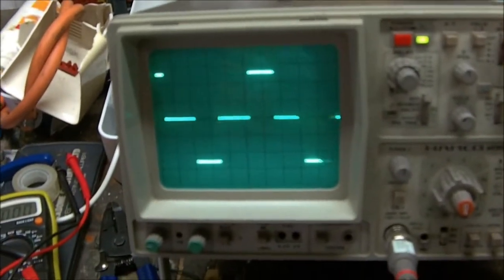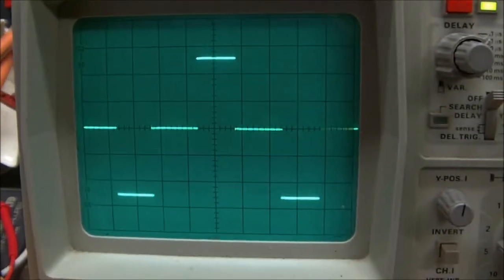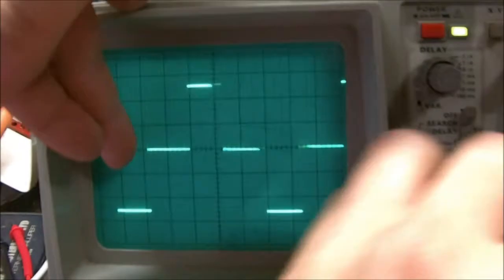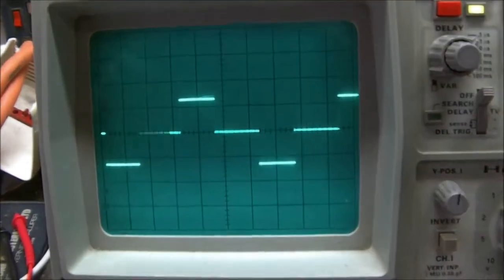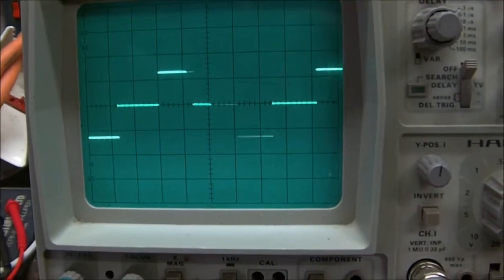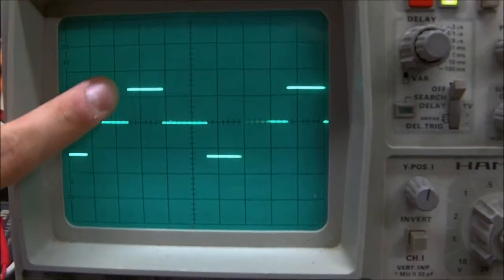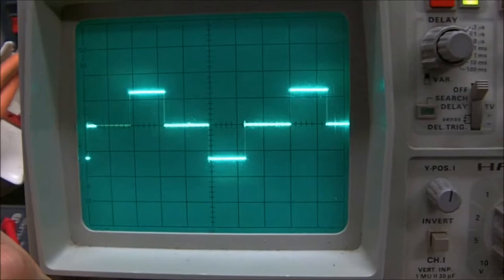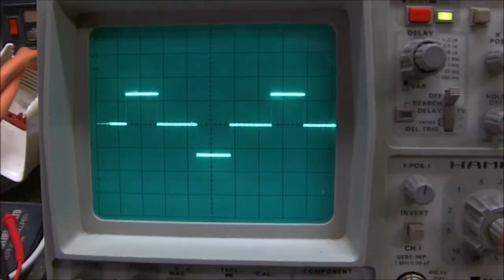If I can try and make that nice and still. How does that pick up on the camera? Might want to give it a bit more intensity - it is a bit better with a bit less actually. You can see that really clearly. So you can see 0 volts, minus 240 volts, 0 volts, plus 240 volts at 50 hertz. Yeah, very faintly we can actually see the vertical lines between those - you can just about see them there with the intensity turned up.